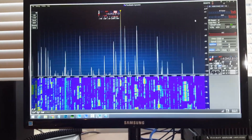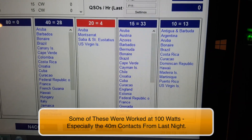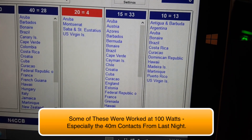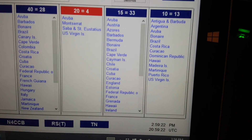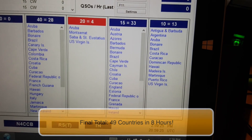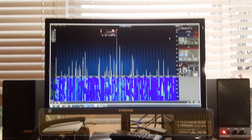I'm going to fire up a camera so you can see me and record the screen while I try to work a few stations via QRP. I've already worked a bunch of stations — I saved 20 meters to do some 20 meter stuff on screen. I've worked a lot of countries; I'd guess I've probably worked 30 countries within maybe three or four hours of operating. Now I'm going to go down to the start of the general portion of the band at 14.025 on 20 meters, work my way up, transmitting only five watts, and see how many stations we can work.